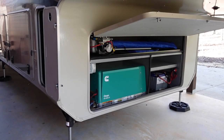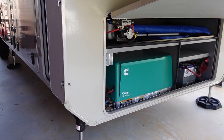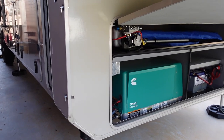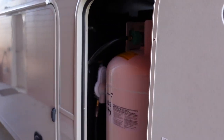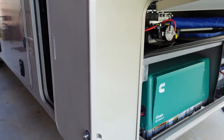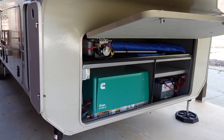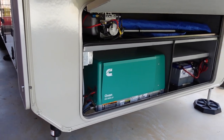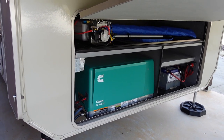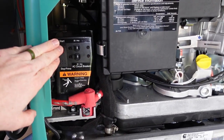Third, as far as this being a cold start test, I have not used the generator for about five days. What you're about to see is the first time the generator is being started after sitting idle for five days. I'm not going to prime the generator — I only do that if I've swapped out propane tanks and there's air in the lines. Since the propane has been connected the whole time, I want to make this a more difficult, challenging start to demonstrate worst-case scenario amp draw.